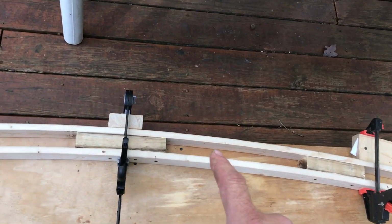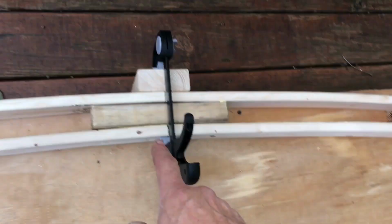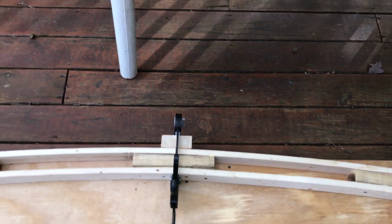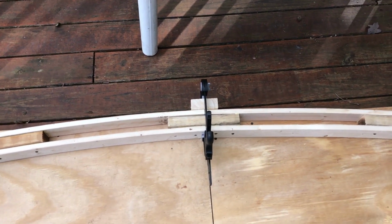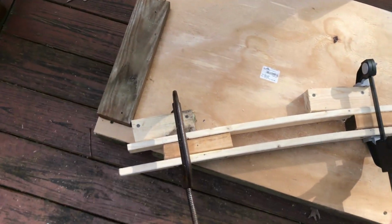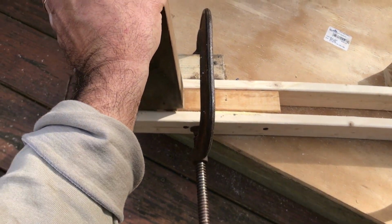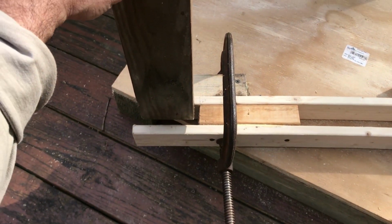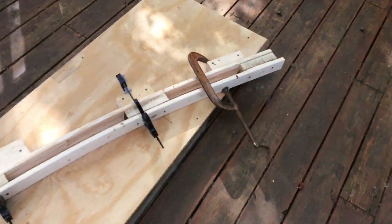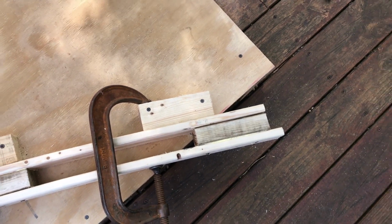In the center here, where there's a seam, because these are 2 8-foot and 2 8-foot, I have them just butted up, and the block is about 9 or so inches, so it gives it a little better support. One more detail is this is the bottom, and I purposely left a space here because this is going to be straddling the 2x4 ledger board as part of the foundation, whereas the other side, it goes to the top, and this will be cut on an angle to form the top of the arch.